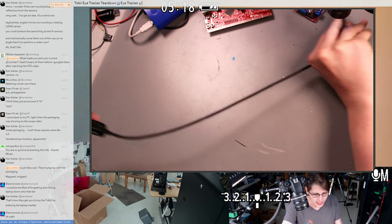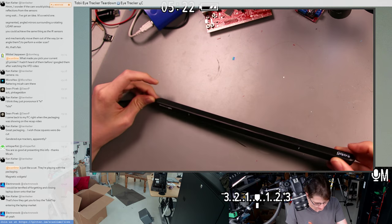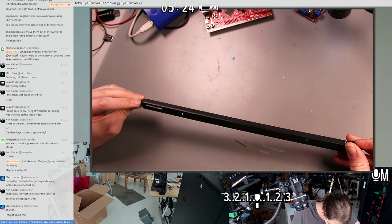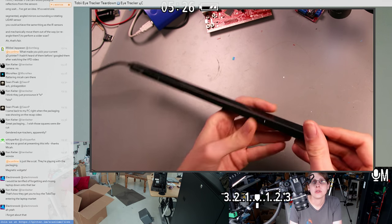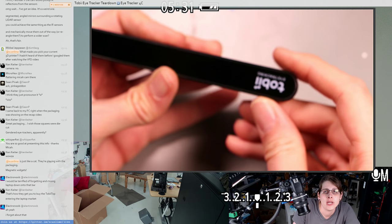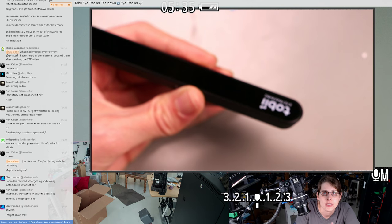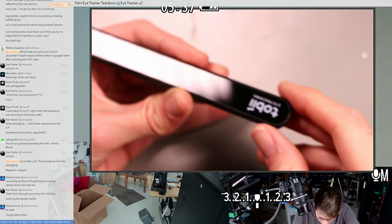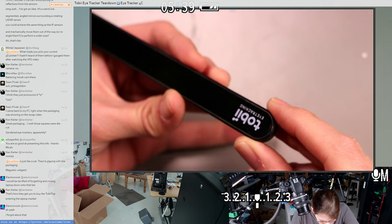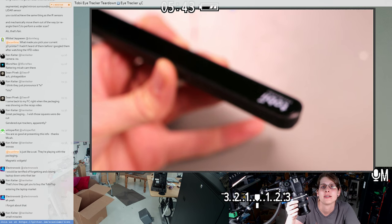On the other one, taking it apart was actually really annoying. If I remember right, the actual housing was, I think, ultrasonically welded, and we had to use a heat gun to soften the adhesive on this front lens, go in that way. And we ended up taking the lens off in many pieces. It didn't end well for the lens.